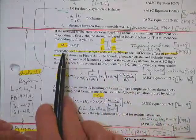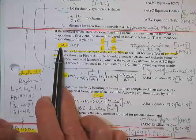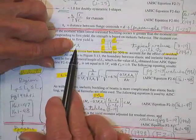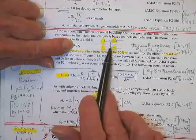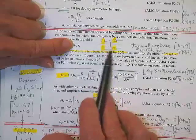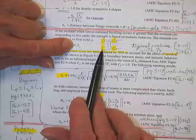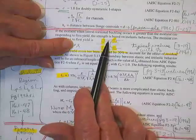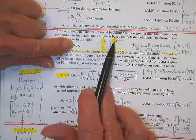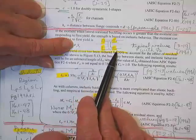That's Timoshenko's again. First off, there is a thing called M sub R. It could have been called M sub Y for M sub yield because it really is M sub yield. The only thing is that's M sub yield: yield stress times section modulus. And because when they roll these beams, this thing's hot, these flanges cool pretty quickly because there's three sides exposed to the air, and the web cools pretty quickly. And when this cools, it solidifies, and this stuff here is still not solidified. So it's still trying to get shorter, and these people say, who's over there pulling on us trying to get shorter? And these guys say, well, the guy in the middle, he's still hot. He's trying to shrink, and we don't want to shrink. You get residual stresses in the beam.